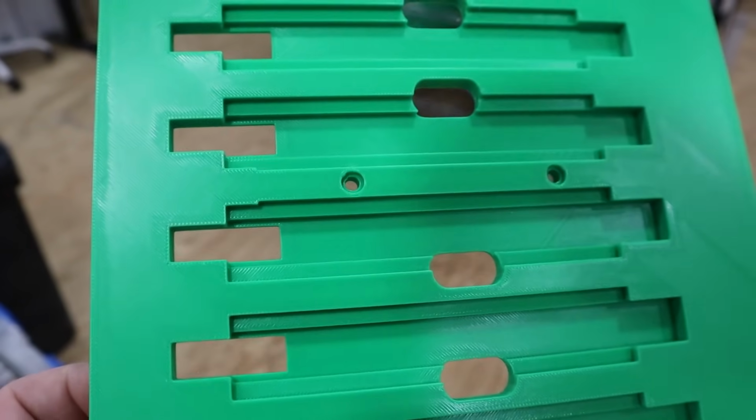What can I do about it? Well, as this print job was running, I did some Google research, started reading into more forums, community posts, and stuff like that on how to dry filament, and if filament is exposed to a moist environment, how to then dry it. So there's steps to dry it from the beginning, and there's also steps people talked about for drying it in my case. The initial thought would be, okay, if it soaked up moisture over a week, just let the dehumidifier run and keep it dry for a week and you should be good.